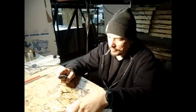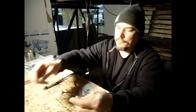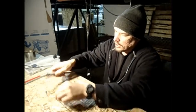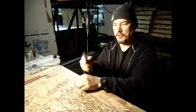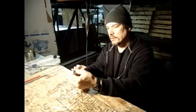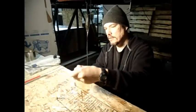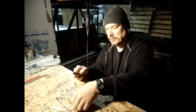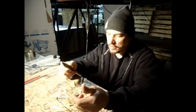I wanted to do a product review today. What I found out is that my bits have different size shanks — they're thicker and thinner. What you have to do is put in a collet that goes inside the tool, and whenever you change a bit, you have to tighten it with a little wrench so it doesn't come loose. If you wanted to change the bit size, you had to put a different collet in — open it up, take the bit out, and put a new collet in. It's a pain in the neck, really time consuming. And if you're working in a dirty area, you'd lose the collet and have to go look for it.